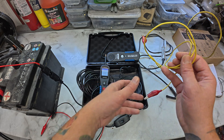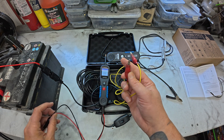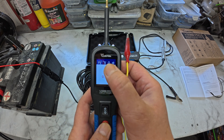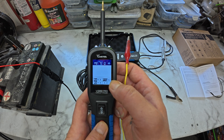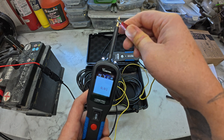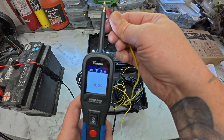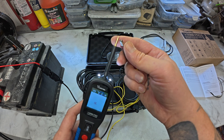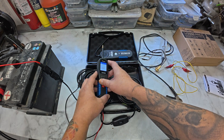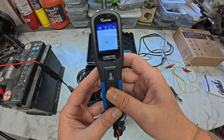Next, we'll do a quick continuity or resistance check. I'm just going to use a standard piece of wire — there's going to be no resistance to this wire. I'll hook it up to the black lead coming out of the tool and switch over to ohms with the red button. It says OL right now for out of limits. Touching the red lead onto the end shows zero ohms, zero resistance, and it confirmed continuity with a beep. So if you've used a power probe tool before, you are going to be very familiarized with this first portion of the kit.